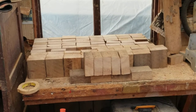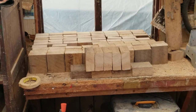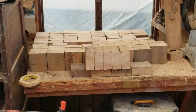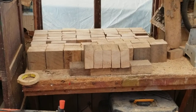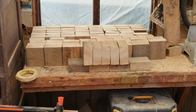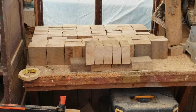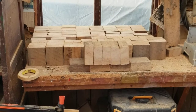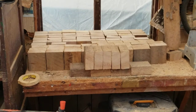I had some old oak two-by-fours that I wanted to make a butcher block island out of, but the boards were so twisted, cupped, and bowed that I cut them into lengths. Truing them up at eight feet would have lost too much wood. In hindsight, I should have cut them into about 10 to 12-inch pieces so I could run them through my planer, but now I'm stuck needing to face plane them.